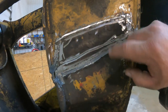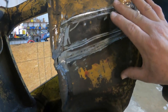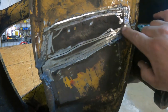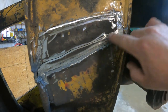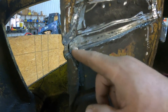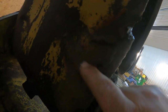After removing this plate, I found a crack right here on the base metal behind the plate. Evidently this was a previous repair that never got properly fixed. So I'm going to bevel this out, clean it out, get a root bead in it, a filler bead, and a cap pass. I also need to check a little spot right here that's taking off, and there's another crack going down in here as well.